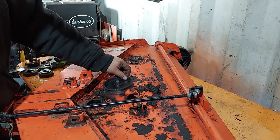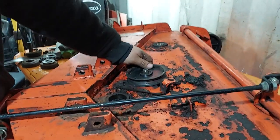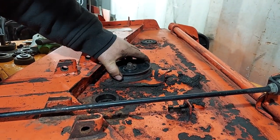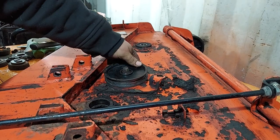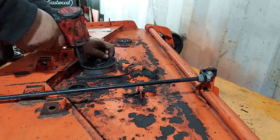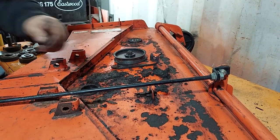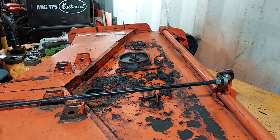Like I mentioned, this was a big part of the issue — why this deck is getting worked on. You can see all the play in there, so there's a lot wrong here. I'm thinking this bracket's worn, this bolt could be worn, it's loose, there was no spring on here, and the pulleys could have some play. It looks like somebody replaced the pulley trying to fix the problem, but that wasn't the only problem. The other bearing in the pulley was probably shot because this wasn't set up right. Usually that's a carriage bolt on there — sometimes you'll find a welded stud, or a regular bolt where somebody replaced it and the square is worn out.